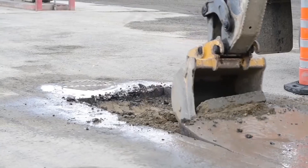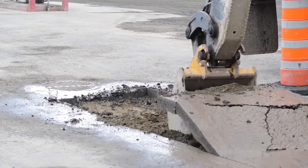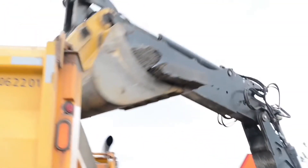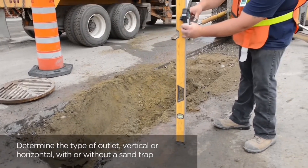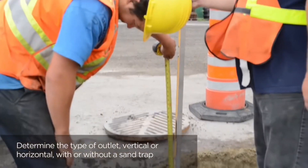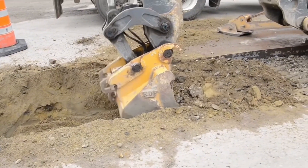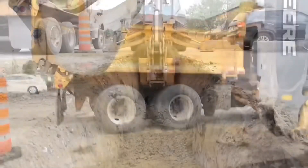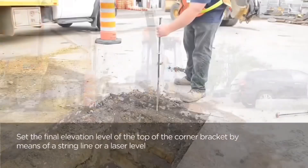If we're working with a 12-inch wide drain, we're going to want concrete encasement on either side of the drain. The heavier-duty the drain, the larger the concrete encasement. For example, a class F load rating, which is the highest load rating there is, requires a 12-inch wide concrete encasement on either side. A lower load rating requirement will have a smaller concrete encasement.